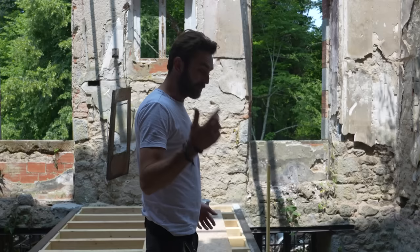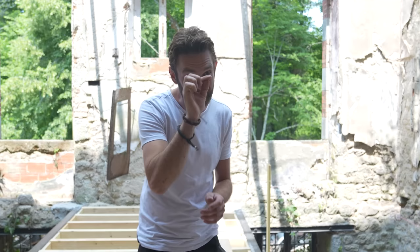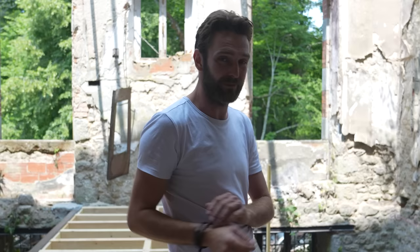Like I was explaining yesterday, there's a bit of a palaver with levels. I think I'm just going to have to do each beam one by one. I think some of them I can notch out. Like, I can just take 2 centimetres out of the bottom of the wood and that'll be fine. Some may be different. Let's just do one at a time and deal with each problem as it comes.